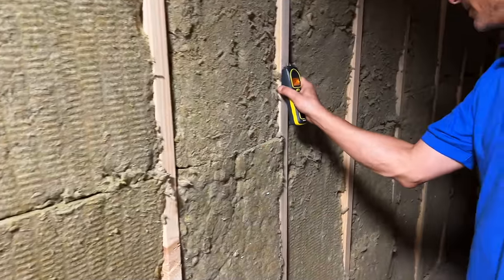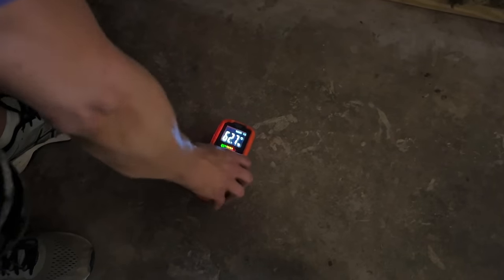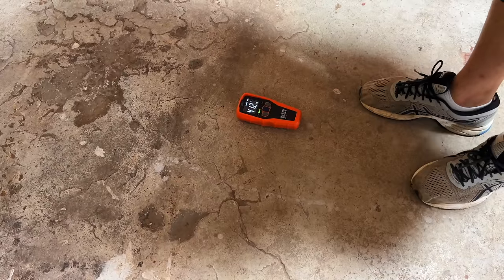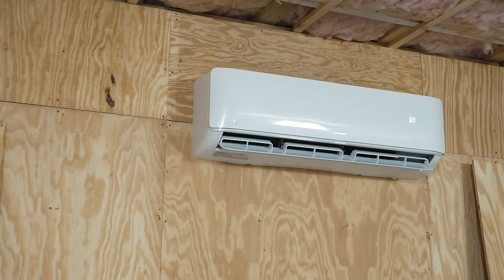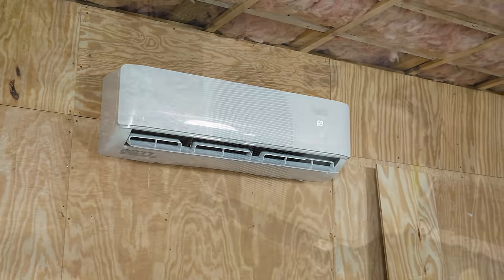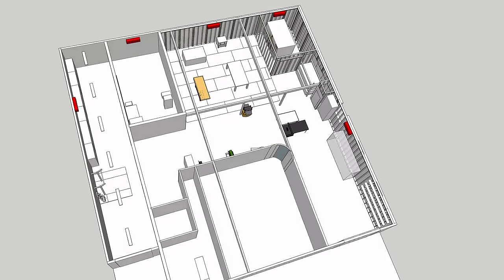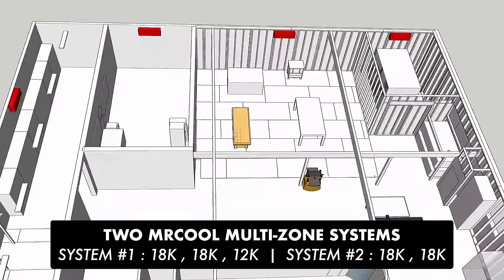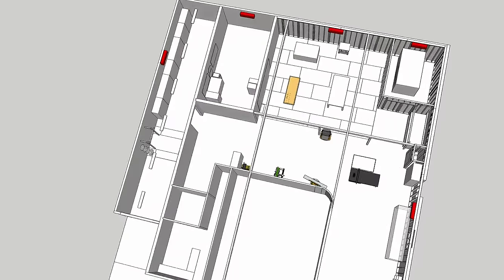I called a local mold remediation company. They came out to give me an estimate, and as expected, moisture was incredibly high in the space. They recommended I get the mini splits up and running as soon as possible to keep moisture down and mold at bay. Because of that recommendation, instead of installing plywood on the shop walls — which was next on my list — I got to work on the mini split installation. In total I'm going to have two Mr. Cool multi-zone mini split systems: the shop area will have two 18,000 BTU heads, one 12,000 BTU head in the CNC room, and the addition and spray booth will each have 18,000 BTU heads.